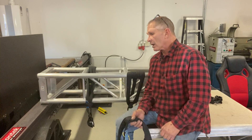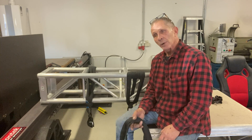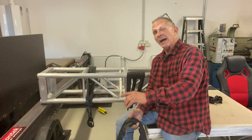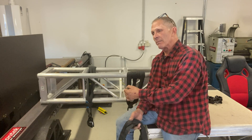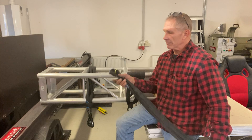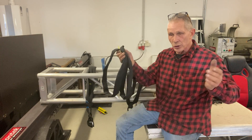So you can put a beam clamp there to stop it from sliding and put it on the backside of the beam clamp. You can ratchet strap it down. You can put a hold back on the choke diagonal to the next vertical piece so that it can only slide to that point and it's under tension — a small leash. But you have to anchor them down when they're on the same beam and leading towards one another.